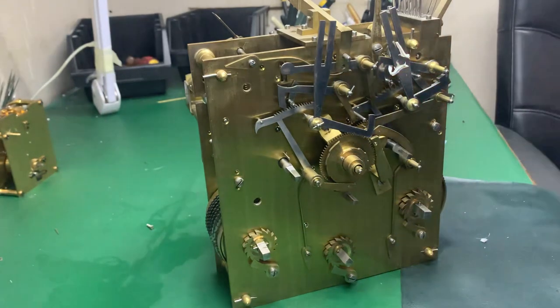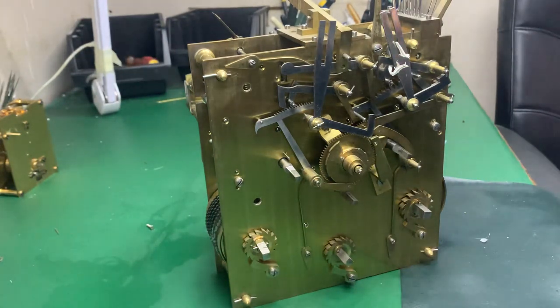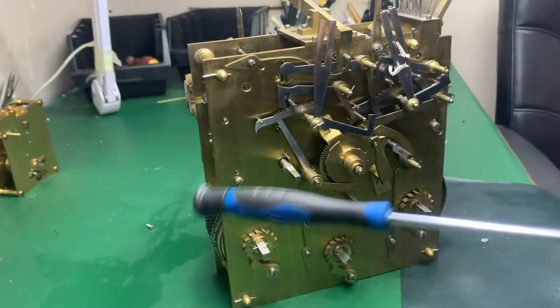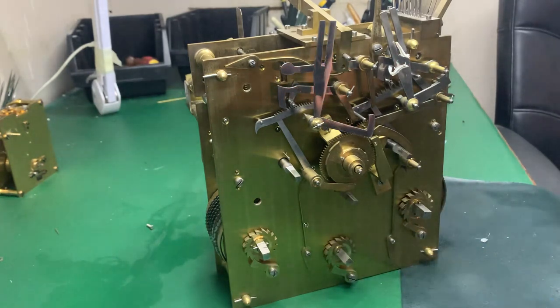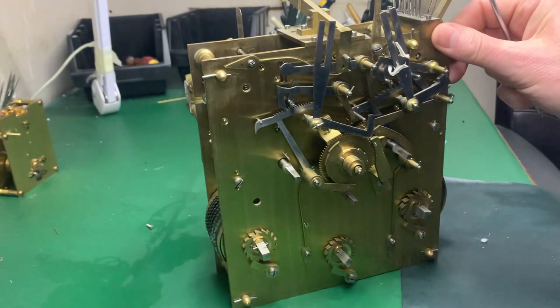Obviously you're going to have to remove your hammer sections. The stands will be the longer type — we have shorter and longer types. We'll also put some kind of protection, probably small pieces of cardboard, so we don't damage or put marks on the movement. Then we'll remove everything in good order, put it all separately, and take plenty of pictures. Everything comes off with pins — very methodical, take your time.